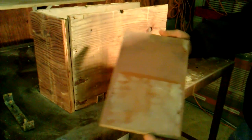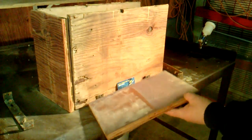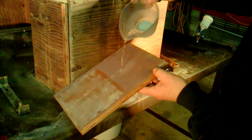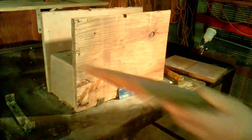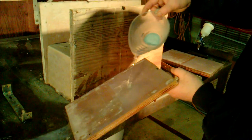You can see that this one here is kind of clouded white — it has the overspray of the top coat on it. This one looks like the concrete had stuck to it, but let me grab some water. You can still see that the form is still hydrophobic — it still beads water. So you could probably get maybe a couple more pours out of it. After I stripped it, it's still really hydrophobic, still repels the water, still dry.